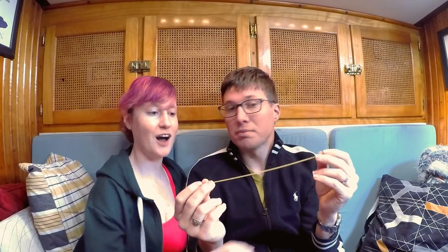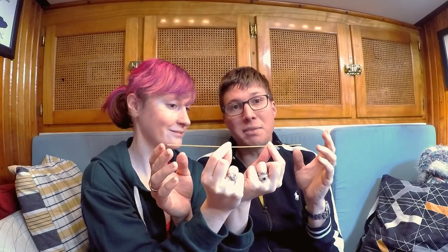So if you look at this spaghetti and imagine it's a mast with a very long unsupported length, you can see it bends really easily — I put no force at all and the noodle starts to bend. But if I put my fingers right here and act as a spreader, it's a lot more rigid. Having fingers in the middle is kind of like a spreader meeting in the middle of the mast, creating a shorter unsupported length. Now if I bring my other hand in, we have two spreaders, and now it's very strong — I'm pushing quite hard and it's really hard to make it deflect.